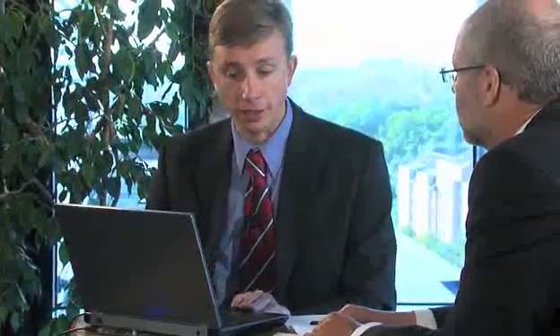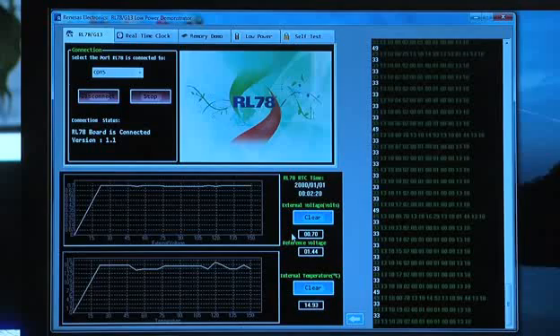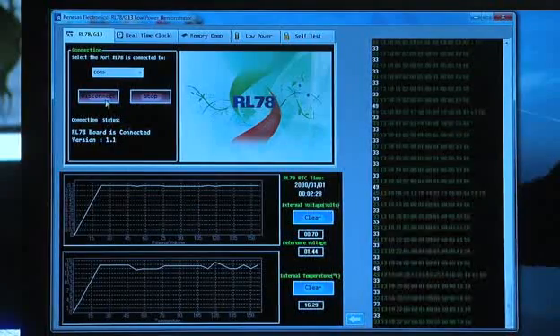Can you demonstrate this GUI to us, please? The board has simple plug-and-play operation — direct connection to the PC via the USB interface. The RPB has basically five windows. The first one allows you to connect the device; it shows you the voltage of the ADC. There's also an internal temperature sensor, so you can see that measurement. The real-time clock I talked about — the 365-day clock — you can start and enable that on the first screen.